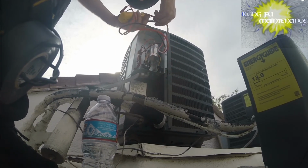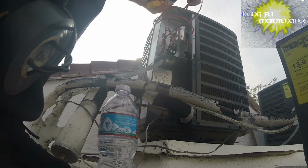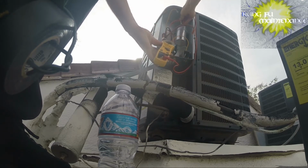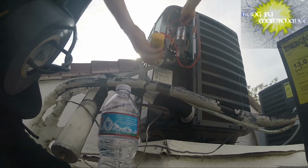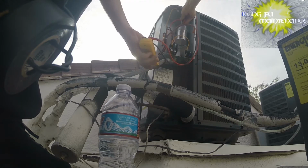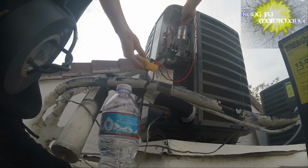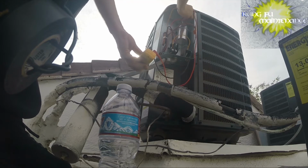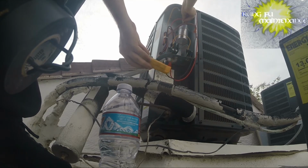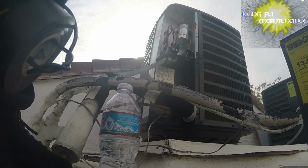Okay, so here we go. Again, we've already discharged our capacitors. And let's see, the HERM is here, the common's here. So here's the common and the fan, and we're looking for 5. Didn't get any reading. Reset my meter here, let's see again. 4.84, that's not bad. And then the 40, going common to Herm. 39.04, we're good. All right, I'm just glad to have checked it. Wanted to just make sure I have a good summer.